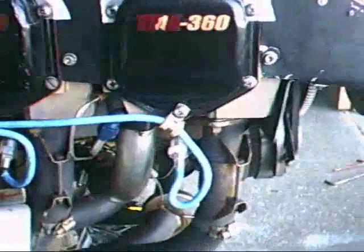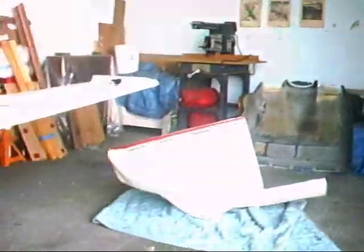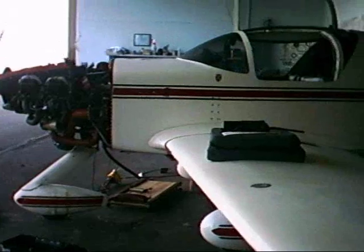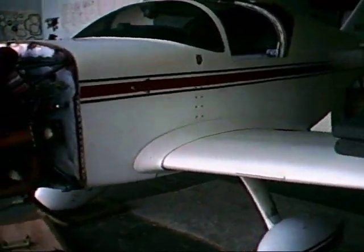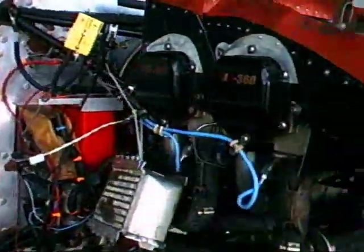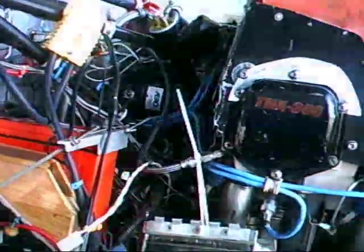Again, disconnect all the wires — no spark, no start. The last thing you have to do, once I get everything all set up, is come over here inside my airplane — just like when you're setting the timing on your magneto, it's very easy to forget this step — the key. You have to turn the key to the on position. In my case, I have it set to both, firing both magnetos, even though only one magneto is boosted. If you don't do that, then the magneto is shorted out and you're not going to get any spark, because the points are not going to register as open and this unit isn't going to sense it.